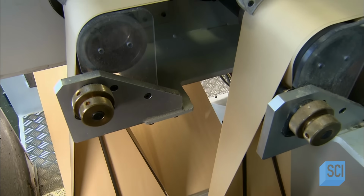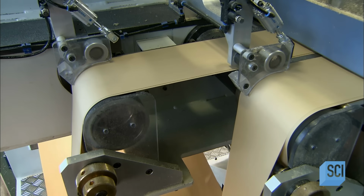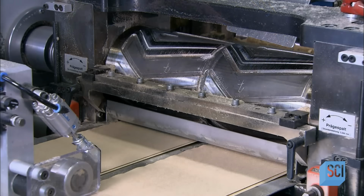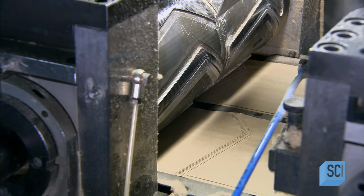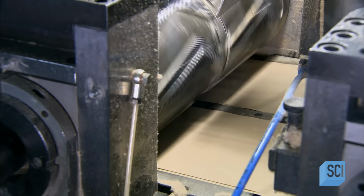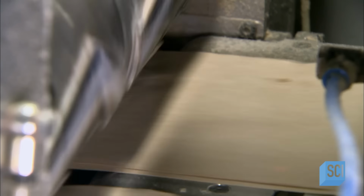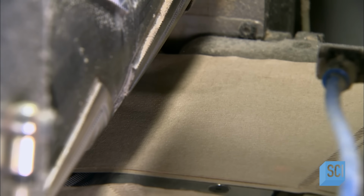Each line immediately enters a folding station, where guides gradually fold the flat sheet in half. A roller embosses a seam connecting the 2 layers of paper along the bottom inside. Then a second roller cuts the conical shape of the filter out of the paper. The machine produces 4,000 filters per minute.